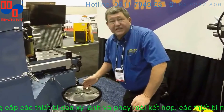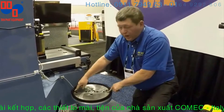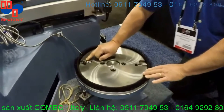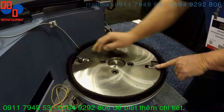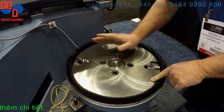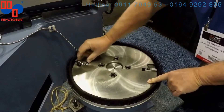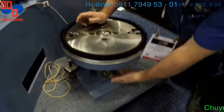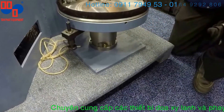This is the standard ACF200 CBN milling plate. It is 13 inches wide and comes standard with two CBN tool holders and the COMEC feature of the incline slide PCD, which acts as a counterweight as well as your PCD. Nothing needs to be removed to switch from CBN to PCD — just loosen one set screw and move it in and out. Very simple to connect to the machine: tighten four bolts and you are ready to go.